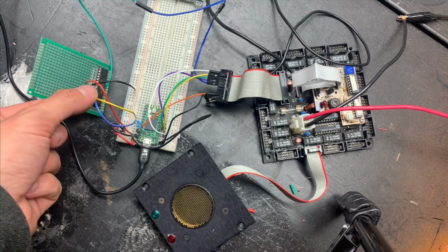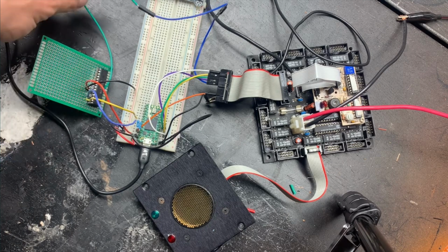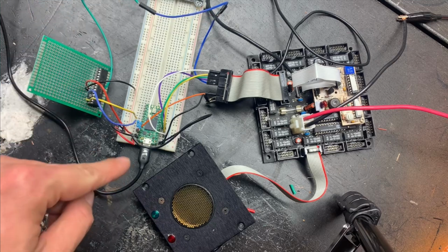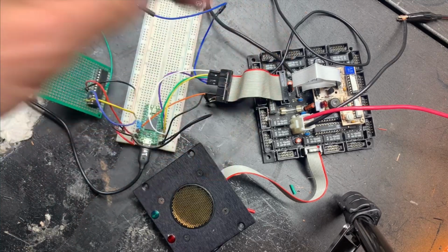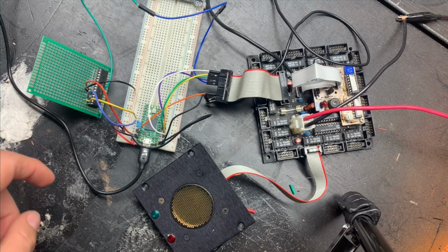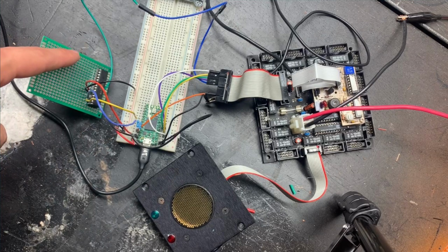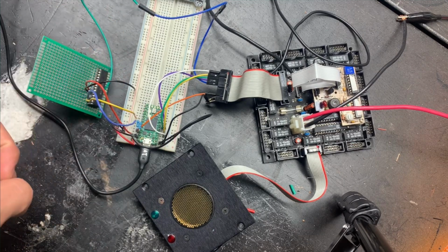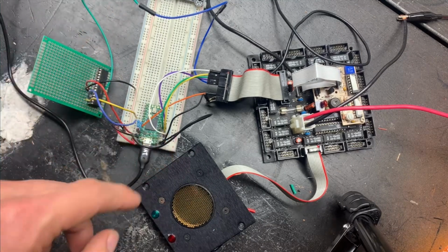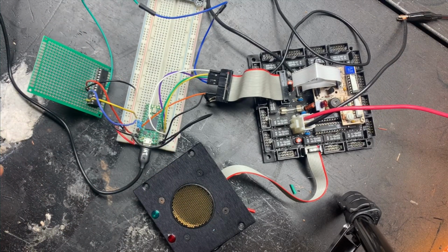That's what these two wires are, and it's taking 3-volt power over those two wires, and then this is its output, which is what the Arduino is telling it to send a signal to pulse the sonar. A couple of reasons I'm using this is because I already have one Teensy in the robot, and using an expander like this, I don't have to add a ton more outputs because that one's already kind of full. Although I may end up doing 2 separate microcontrollers anyway because they're both individually doing really timing sensitive things using interrupts and holding functions and such.